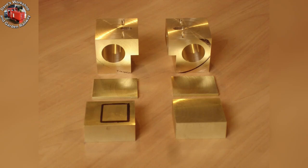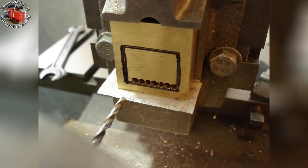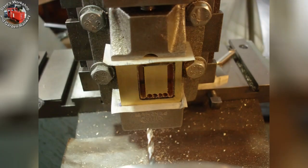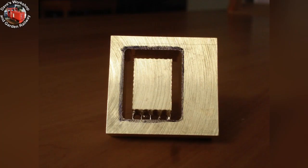Here are the cylinder components. One steam chest cavity has been marked out. I use permanent marker pen and my digital caliper for marking. Chain drilling 1/8th inch holes to remove the bulk of material before I used the 1/8th slot drill for milling. The slot drill was only long enough to go halfway through the job, so the job needed turning around to mill both sides. The long cuts are done both sides, and now I'm starting on the first end.